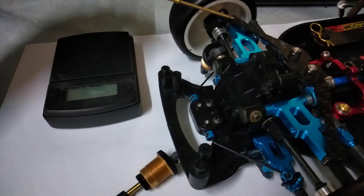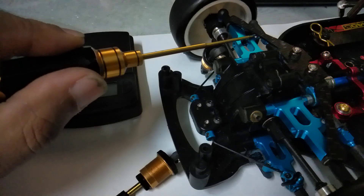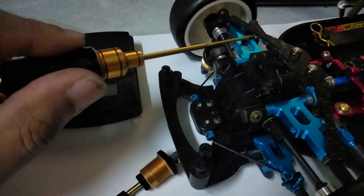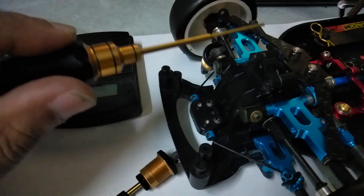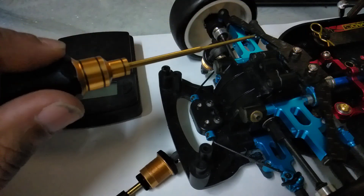The carbon spring is dual rate. I have a set screw here that, when it engages the spring, the spring rate stiffens a lot — so it's like a bump stop but not as harsh. It can be set very fine-tunedly and easily, so when the car is rolling I can easily set it where it will stop rolling.